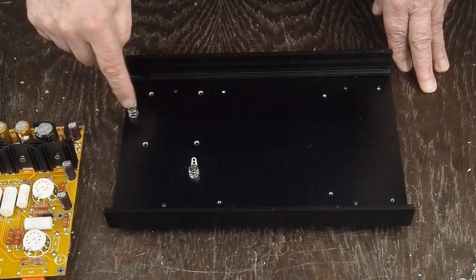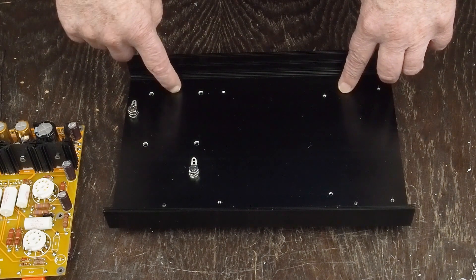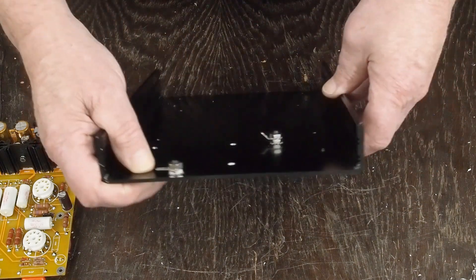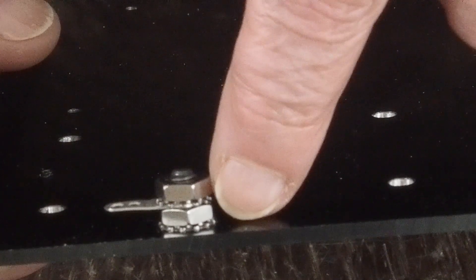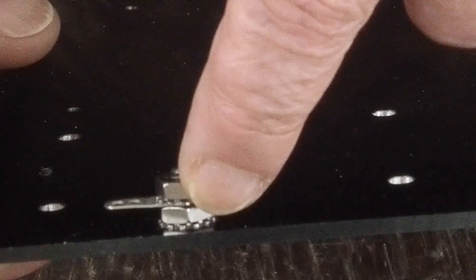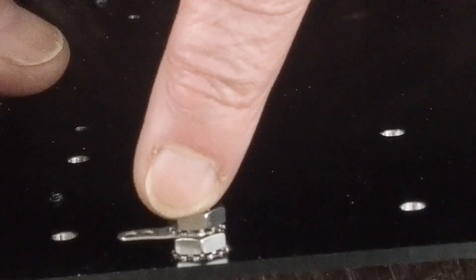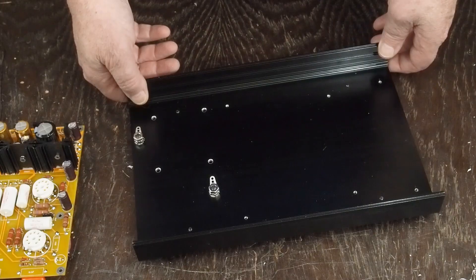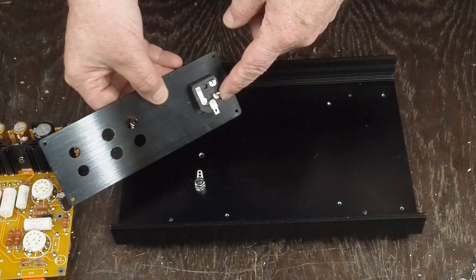On the inside there's a ground point here and a ground point here. Here's where the feet bolts come through, and here are the holes drilled for bolting down the transformer. For each ground lug, I drilled the hole, scraped all the anodizing off, put a K-nut and tightened it down tight against the chassis, then put the solder lug on it, and another K-nut with the star washer built in on top to sandwich it down.